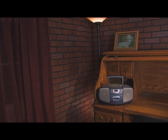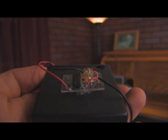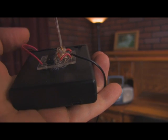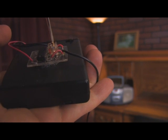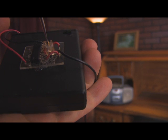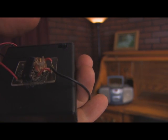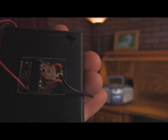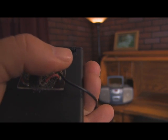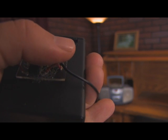So your glue is dry. You're ready to test it out. Set up an FM radio — we've got some nice music playing. Maybe your neighbors don't play such nice music. Well, if that's the case, I certainly wouldn't recommend doing anything that was illegal. But if you happen to have a jammer in hand, you will turn it on with the switch at the top, and then reach down with a small screwdriver — a plastic screwdriver, or a television alignment tool works the best — and tune very, very slowly. You find a spot right there where that music goes away. Now the screwdriver is acting as a bit of an antenna. Your range is going to be about 30 to 50 feet. If you slightly detune it so that you're just very slightly out of tune, you can often jam with a finger, just by getting a finger close to it. And that's a great magic trick.